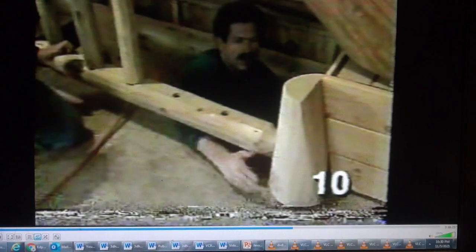When those are in, we glue on the handrail, which we drilled to go over the dowels and the spindles. We then move the assembly into place against the log stringer and finish securing the last two spindles.